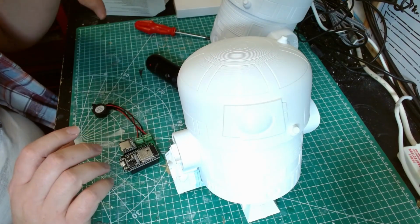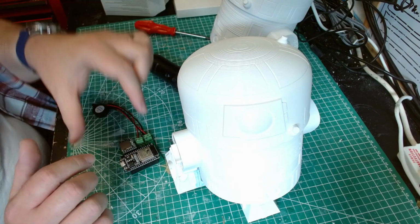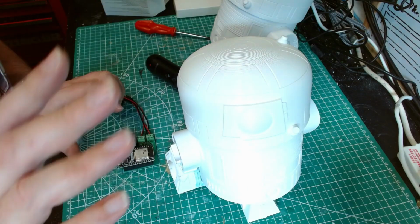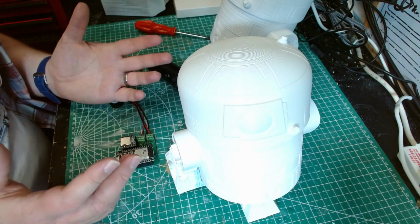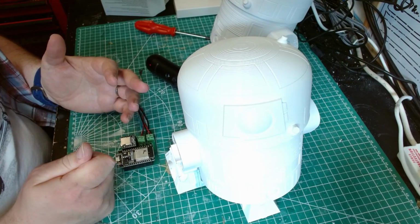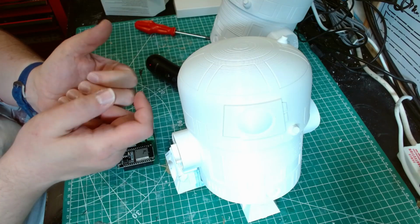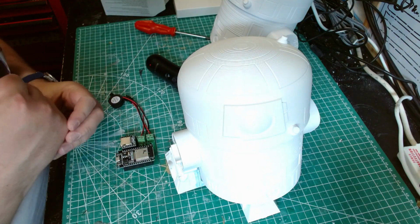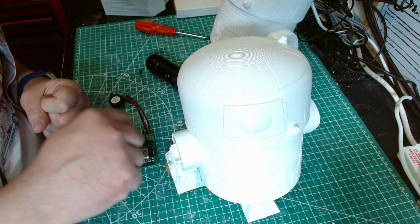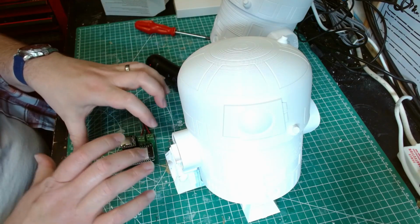To get the MAC address of the controller, there's another script that you put on the ESP32 to begin with, and essentially it's looking for any PS3 connection coming in. It's the pairing mode. You make sure it's plugged into your computer with the serial monitor running, and then it'll allow any connection from any PS3 controller, even a normal twin joystick one, and then it displays the MAC address. You then copy that MAC address out, put it into your other sketch, reflash it, and then when you hit connect, that should connect.